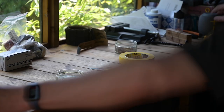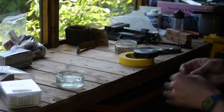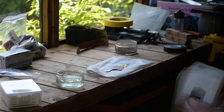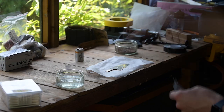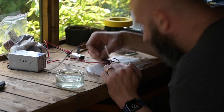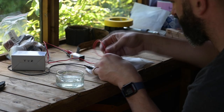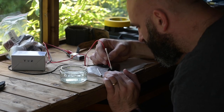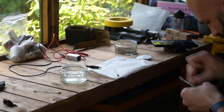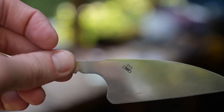I then had a little bit of a tidy up and decided to try a new trick I had learned: electro etching. I'm going to do a full video on how to electro etch your knives, but essentially you attach a 9 volt battery to a cotton wool swab and use salt water to etch the surface. Unfortunately one of the videos I looked at had the polarity back to front — it makes lots of noise and fizzing but doesn't actually etch at all. I'll make sure I get that right in my video. And there we are — the finished etch, the little Tipple logo.